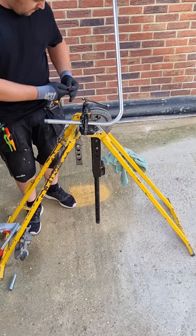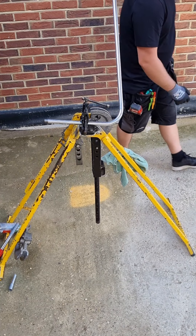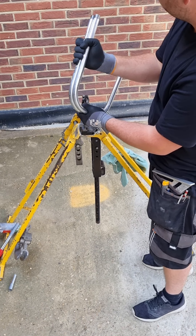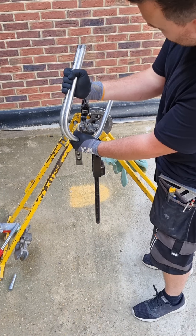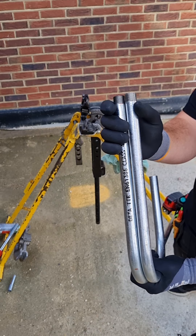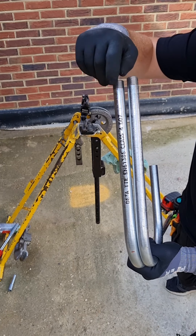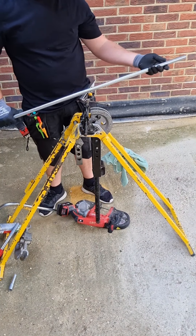Keep it at the end. We'll offer it up next to this other piece of conduit and it should be exactly the same. Just line up the bends — the backs are the same, as you can see. Pretty spot on as far as the thread goes. This one is a shorter thread, but that doesn't matter — it's not about the length on these, it's about where it ends. So that's the back of the bend and the back of the thread method, both done now.